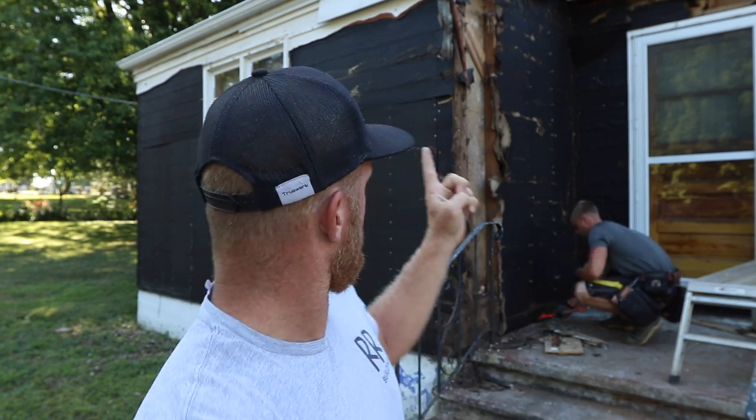First off, we've got a Celotex sheeting, which normally I would say, if you're just gonna install some vinyl, probably okay. You're gonna get by with leaving it there if it's in good shape. However, not all of this is in great shape. We also are finding that there's no insulation in the wall cavities. So now the question is, well, it's not really a question. We're making a determination. We're gonna have to tear all of the Celotex off, add insulation.